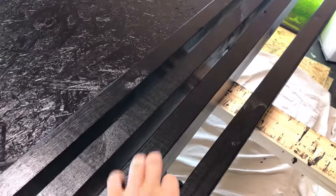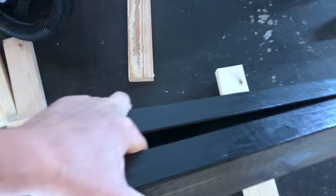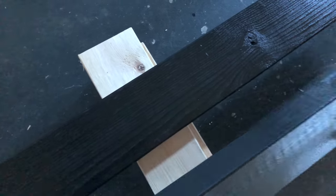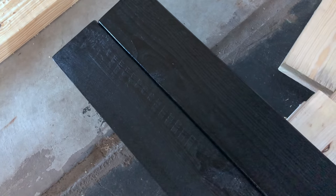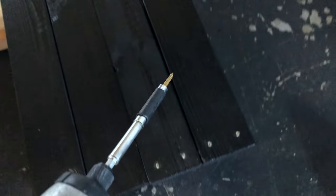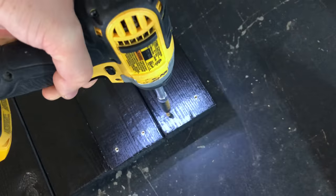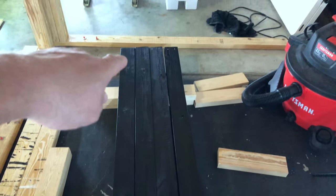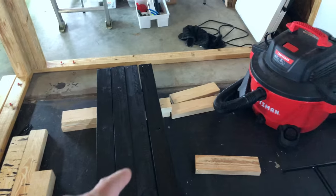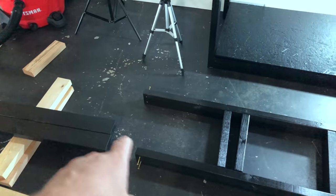Now to get the pieces for the square platform we're gonna set a sump on, which usually I do the square first, but I just happened to grab the legs. And they both go together and gotta get built at some time. Screw and pilot a hole, and always remember to try to keep it as straight as possible. And luckily I remembered not to drill these two, because we're gonna double up the square on the bottom for stability, you'll see here. All right, so I got my front and back, and then I got two side pieces. And the side pieces, I've got these at 13.